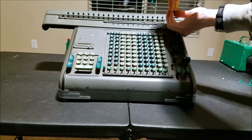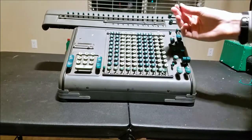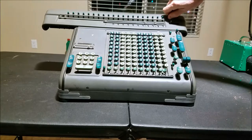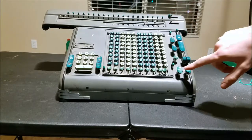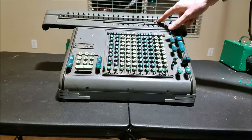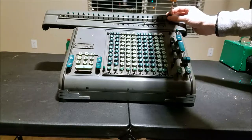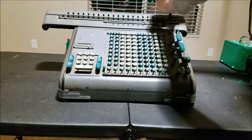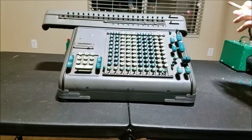Because they are two-position knobs to engage or disengage the counters for clearing. You can see the spring there on that screw. So that comes off. You can either turn them that way — because of this automatic return clear button. So if you turn it that way it should disengage. You push return clear and it won't clear this register. If you turn it the other way it will engage and clear this register when you push return clear. There are four screws on the side of the carriage here that will have to come out.